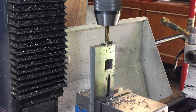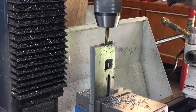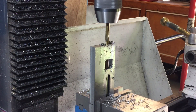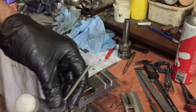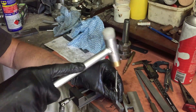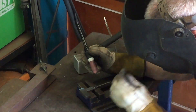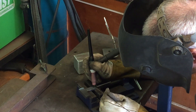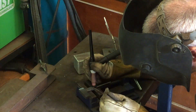Time has passed and this is version 2 in the mill. I'm drilling right through both pieces together so I'll get everything aligned and hopefully get that hole in the right place. I started with 12mm stock this time instead of 10mm. I didn't like the idea of welding right on the end of the tongue, so I've just put a hole in the side of it right on top of the milled-down threaded rod — welding up that hole will secure the rod.